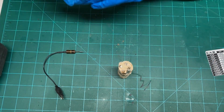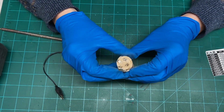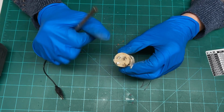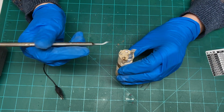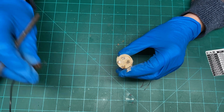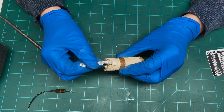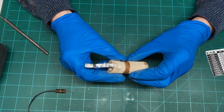That would help also. But one thing you don't do, and I've seen technicians, especially older ones, do this in the past, they'll just take a screwdriver and just short between these two, and you don't want to do that. When you do that, a capacitor has a lot of energy in it, and the energy gets suddenly released, and you can literally blow the bonding strap right out of a capacitor. And then of course the capacitor is ruined for life. I mean, it's a goner when you do that. So don't short those out. You'll just ruin them. Use a 100 ohm resistor or something to bleed that off a little better. A lot of open capacitors are just that because the bonding connections got destroyed by a short.